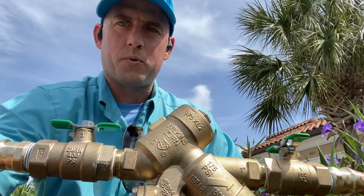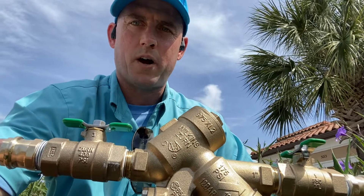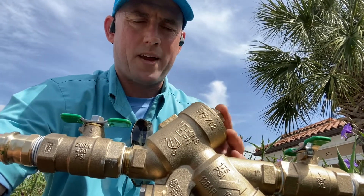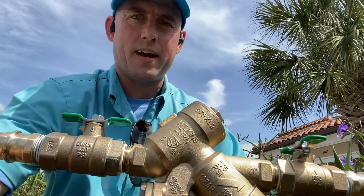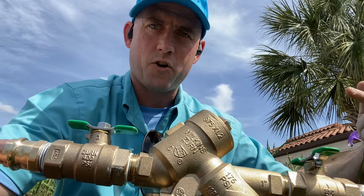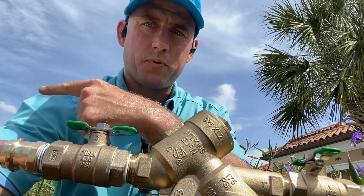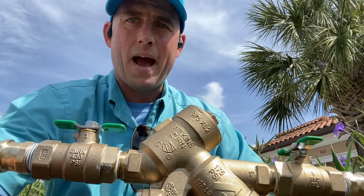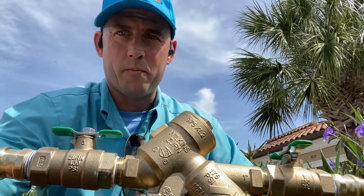The reason for this is to protect the municipal water supply and keep everyone healthy and safe. The biggest reasons we have backflow preventers are to protect against one of two things: back pressure — pressure pushing back from your home into the municipal water supply, which is pretty extremely rare — or back siphonage, which is a more common occurrence.